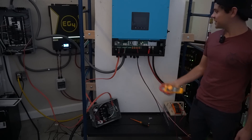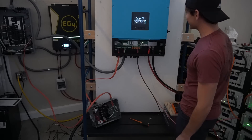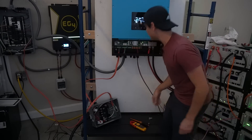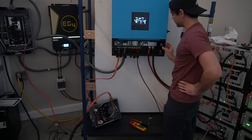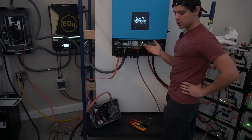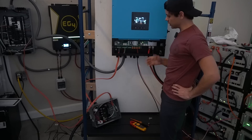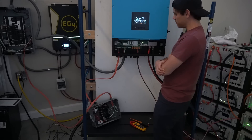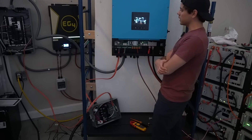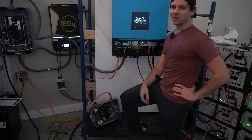It just turned itself off. That was a massive amount of current. F32 is the new fault: DC over current — restart the inverter; if the error message still remains please contact your installer. Why won't it limit the charging current? I verified that the settings were saved and everything was good — I don't know why it pushed that much current. I want to restart it but it doesn't really have an off button, so I think I'm going to have to disconnect the battery yet again because the AC output is turned off as well. This needs new software.